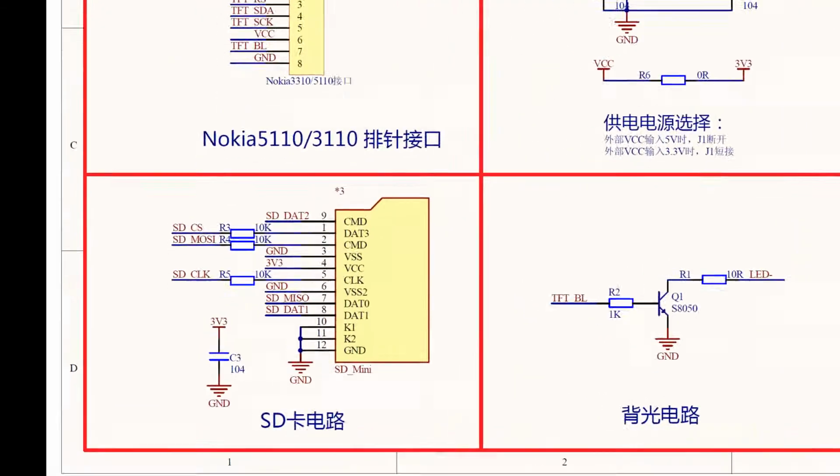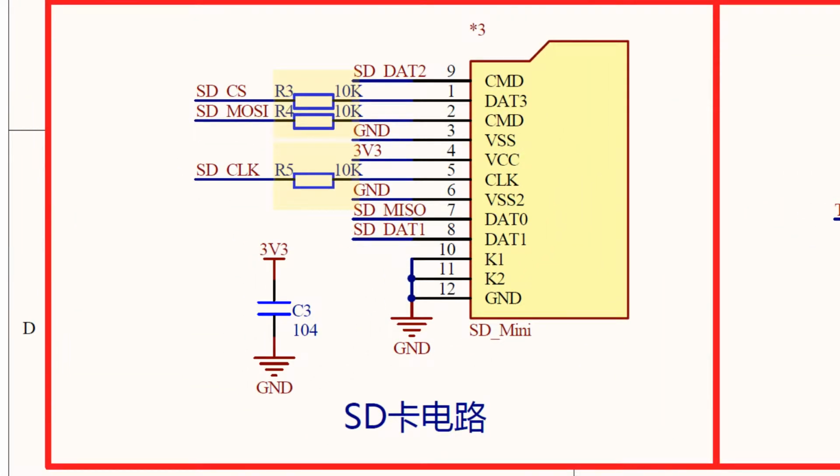We already said that the speed limit is due to these 10 kΩ resistors, which are in series to each SD input line. They prevent any damage when the SD card is connected to a 5-volt system, such as our Arduino. However, such resistors form a low-pass filter with the SD and track capacitances, blocking the high-speed signals.